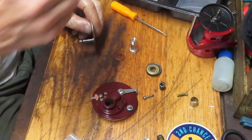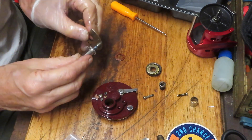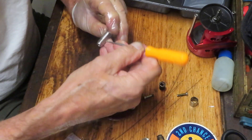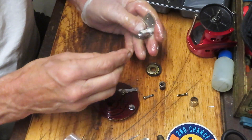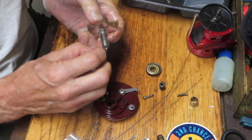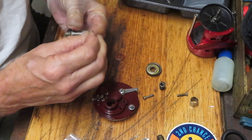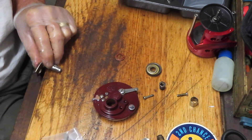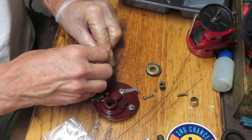We can take the grease now and put a little bit onto the gear shaft. We have the pin safely lodged in here. Bring that in, insert the new pin. This is a stainless sleeve. So when you're looking at upgrades, you're not just looking at doing a solid frame — we're also looking at an upgrade in materials. These are stainless. Now you can bring the gear sleeve washer back on.